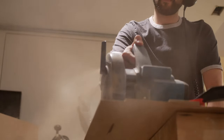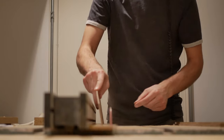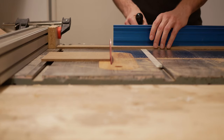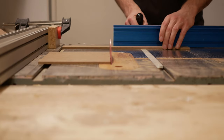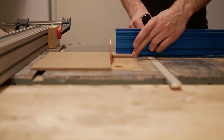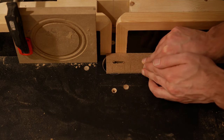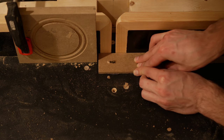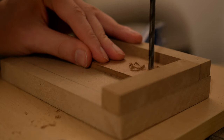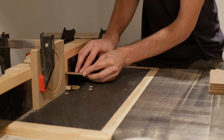Now I just need to make the small bottom bracket with the vents in it, and I start by cutting up some quarter-inch MDF. For the vent holes I first tried to drop-plunge it on the router table, but I don't really have the correct bit to do that and it was a lot of effort. It was easier to drill a pilot hole on the drill press slightly smaller so the bit could pass right through. I used stops on the fence again for repeatability.